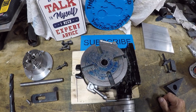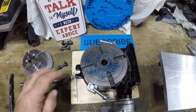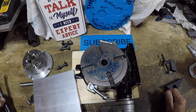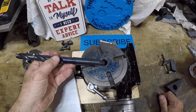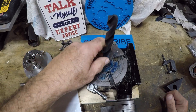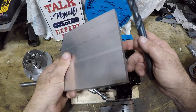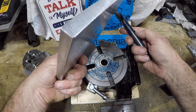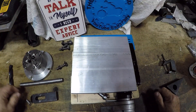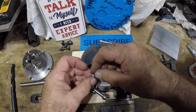Welcome back to the shop. Today we are going to make a fixture plate for the rotary table. I need to make a mounting pin — I'm going to turn a number two morse taper that goes down into it, thread this end, drill a hole in the fixture plate, screw the fixture plate onto the mounting pin, and then stick it onto the rotary table using countersink screws and T-nuts to secure it to the table.